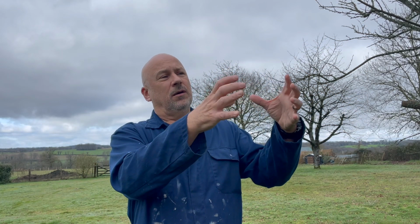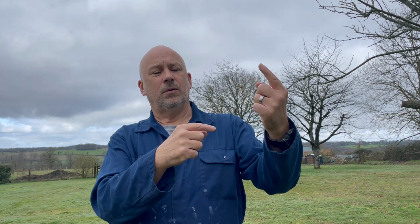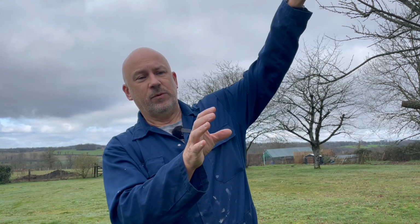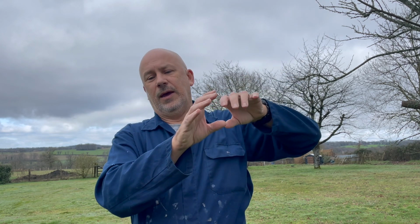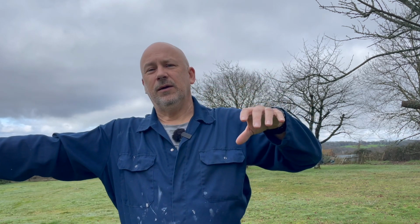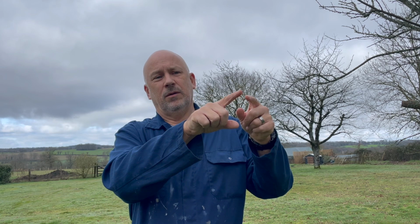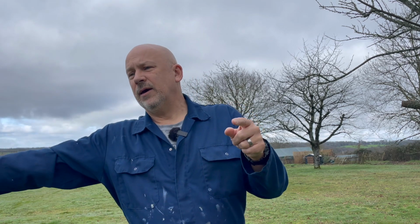Where it's hung from the ridge beam, the extractor pipes come up into the box, and then fresh air is drawn in from a pipe up from the roof, and the moisture laden air that's extracted from the bathrooms is pumped out to an exit in the eaves of the roof. Well, when the guy had put this in, you'll see in the picture that the pipe had come out of the bottom, gone up over the ridge beam, and out.